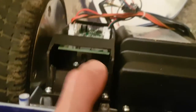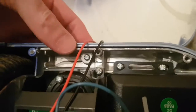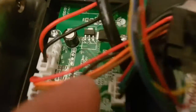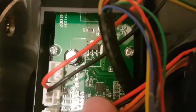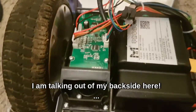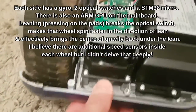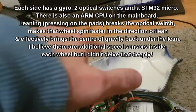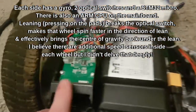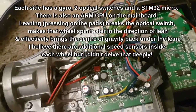What we've got here are two optical endstops — see this black U-shape? That's an optical endstop, and it gets broken when you lean on the pad. One on the front, one on the back. In addition we've got a gyro here — exactly the same thing you'd get on a quadcopter or racing drone — and a little STM32 microprocessor. What I think is happening is it's like auto-level mode on a drone, where it's trying to level itself, but if you tip it, it will maintain that pitch and move forward. It's got one of these on each side.